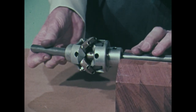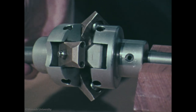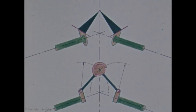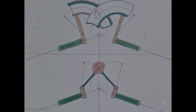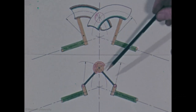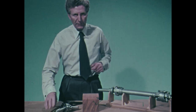Here's a coupling designed at the University of Sydney by Arthur Sherwood and Jack Phillips, consisting of three ball cup joints on hinged arms in the tripod and reflection form. Although this one is quite new, it's closely related geometrically to many known couplings used, for instance, in front wheel car drives, where the balls run in tracks. Their basic kinematics too derive from the reflected tripod, because a pair of crossed symmetrical tracks keep the ball in the plane of symmetry, just like two symmetrical pivoted arms do for the center of a ball cup joint. Here now are a few front wheel drive couplings.